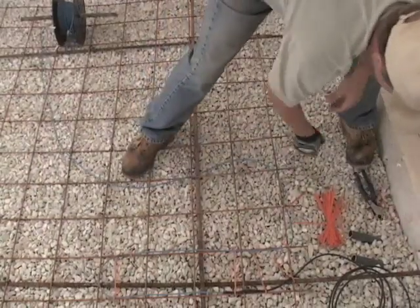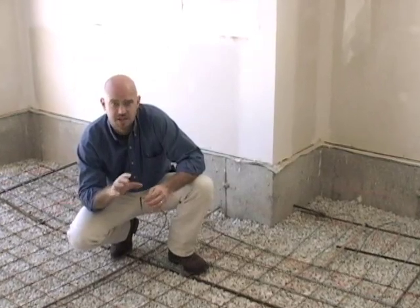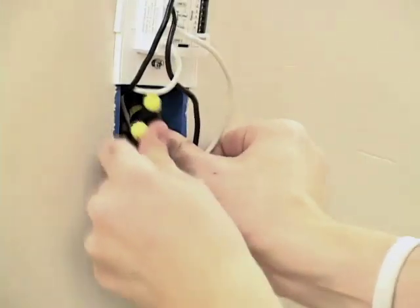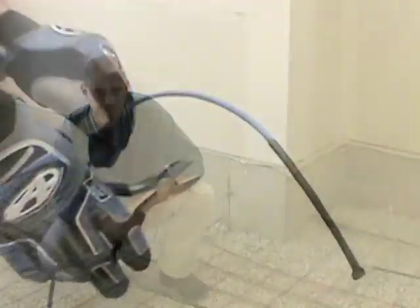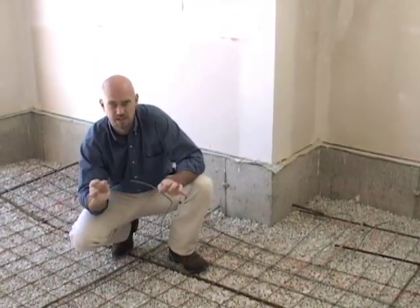In this application, we're using several spools, so we need to know what area is covered by which spool. One great feature of the slab heating cable is the end splice, which completes the circuit so you have one connection point to the control. Make sure the end splice stays intact on the job site — do not cut it to make it shorter. Doing so will change the heating output of the cable and potentially change the wire temperature.